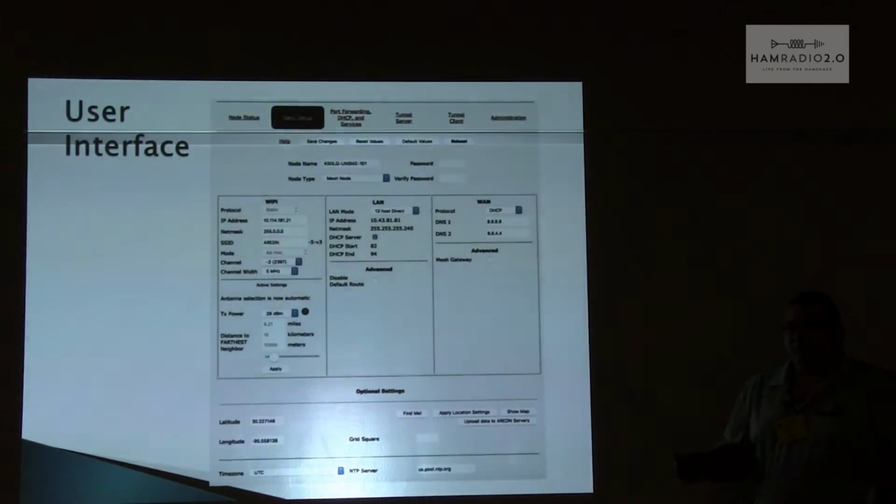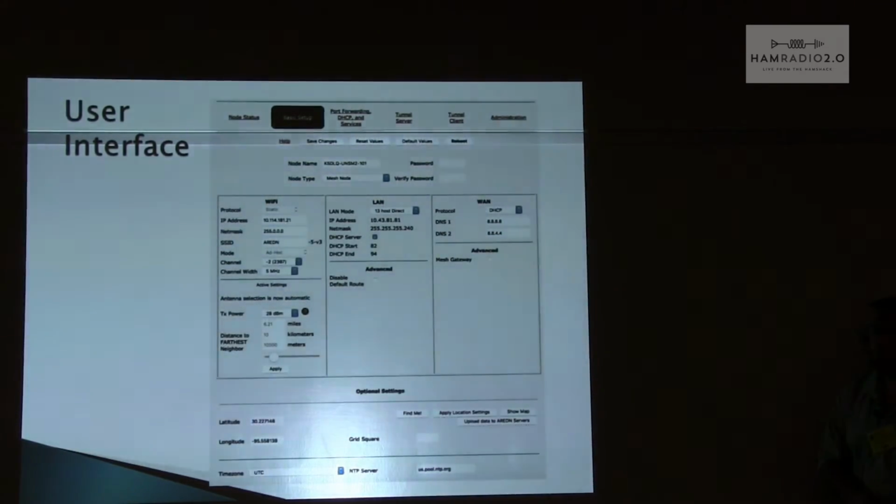And those of you who are still using BBHN that want to continue it, that applies for that too, especially on the Ubiquiti devices. Don't leave it as the default 0. There's actually a help bug that says that that's automatic. It's not. So just a little bit of a tidbit there that applies to both. A few other options down here are completely optional. You don't have to do them, latitude, longitude, but really that's what matters for getting a node up and online.